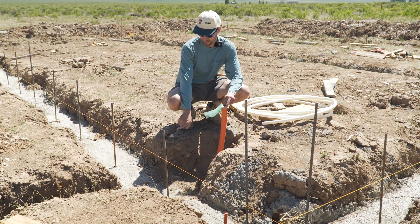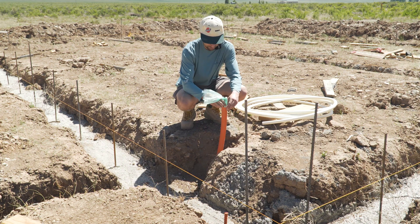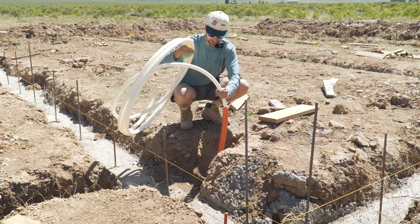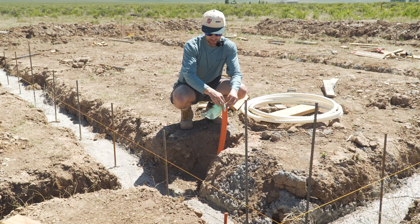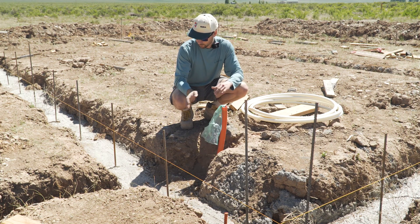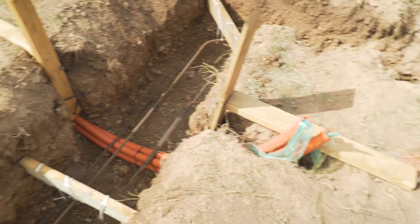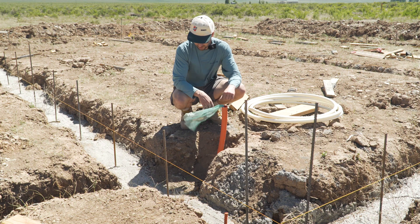When it comes to these penetrations, this one actually goes underneath — it doesn't penetrate the footing itself. It's buried deeper and then was backfilled and compressed. These plastic bits are just a plug so I didn't get any concrete or dirt down in there. This one's the fresh water, so this is going to be a PEX pipe — the idea being that I can feed it down and it'll come out the other side. It also allows me to replace the PEX later on, so I don't have to worry if I'd just buried it and a crack happened underneath. This will allow me to pull the PEX out and replace it if I ever need to. Same story for the electrical on the other side — you might have noticed there are three coming out there. That's going to be because I'll separate the conductors and have the two hots and the neutral each coming through on their own. Probably an unnecessary safety measure, but this stuff's cheap and burning down your house isn't.